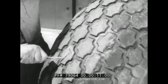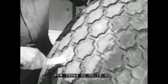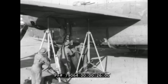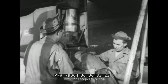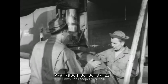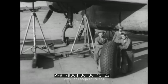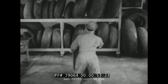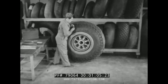Foreign objects can be removed, and small cuts which have not injured the casing can be cleaned out and repaired by cementing tire filler in the cut. When removing airplane tires, make sure the jacks are handled properly and that the tires are protected from oil and hydraulic fluid by canvas covers. Whenever possible, tires should be serviced by men trained for this work in a place equipped for tire servicing, where the floor can be kept clean and there are enough tools and permanent equipment to do the job quickly and thoroughly without exposing the tire and rims unduly to accidental injury.